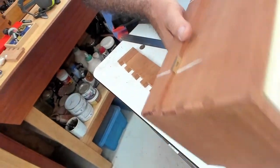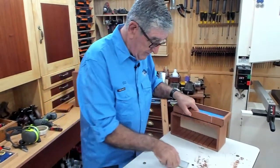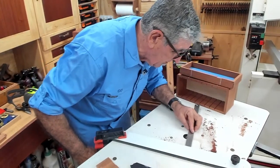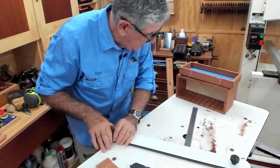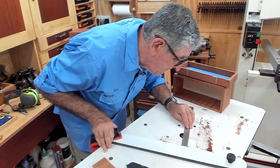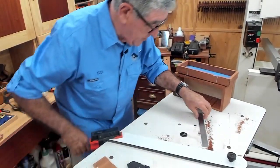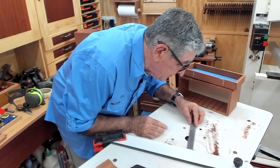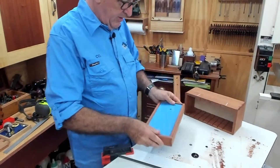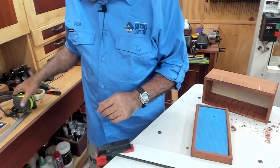So I'm going to do this bottom one now. The bottom one was a different measurement, 66 millimetres. The reason I'm doing 66 millimetres, for those of you who missed the first bit, is I'm trying to get between the shelving sleeves. Just check that. This time I'm on the other side, so sit over the top of the round bit.